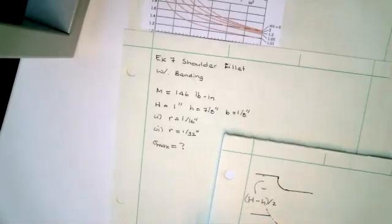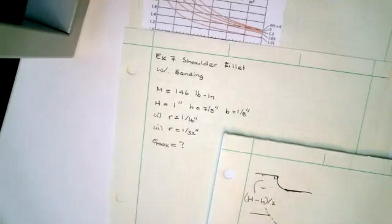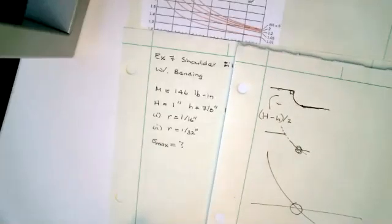The problem is here. When you put this big radius in, it's not really a problem there. When you put this big radius in here, it doesn't meet. It meets with a little sharp corner here. And so if you put in a bigger radius, this radius comes in here and it's tangential to the outer surface. And it's at 90 degrees here, but the key thing is it's tangential here. If you put this big radius in here, then you get this local corner. It comes down and it hits this, you get this sort of corner, and that's not good. Okay, we'll talk a bit more about that, but that you want to avoid.